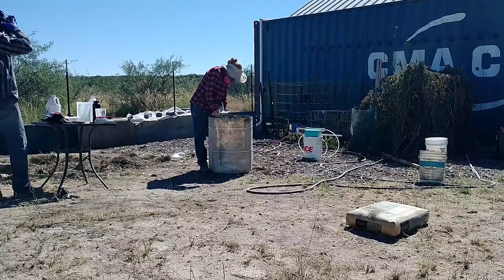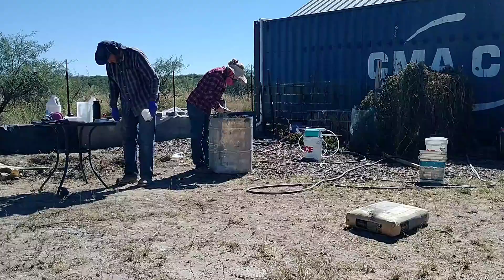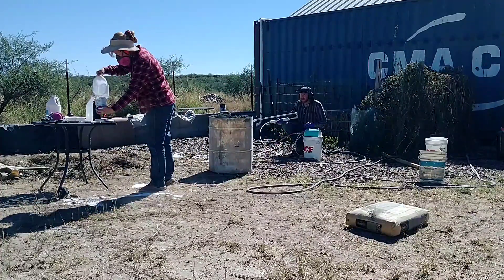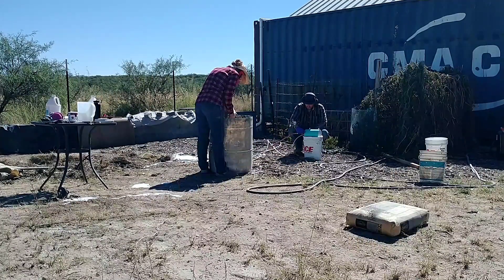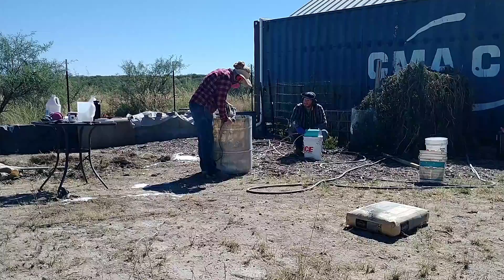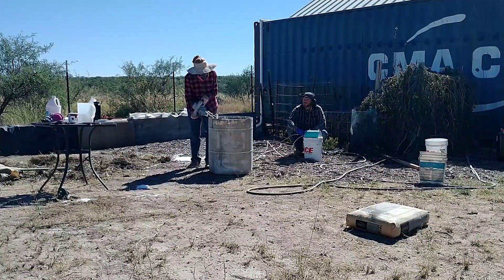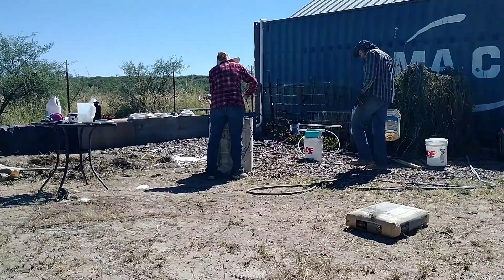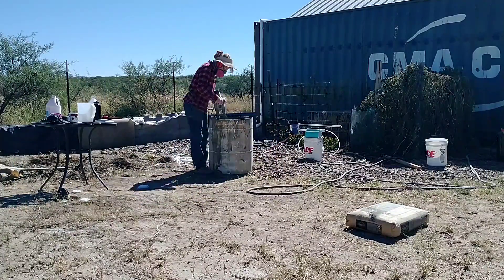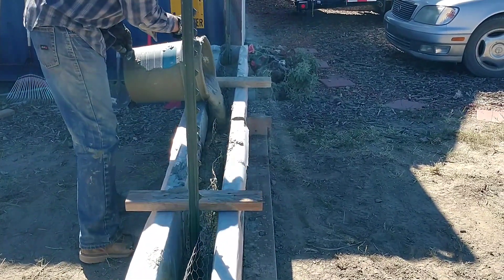We really didn't know how it would work, pouring that deep — whether it would hold up, and whether pouring one batch on top of another with 15 or 20 minutes between batches would cause the air bubbles to start releasing. What we found is that the aircrete seemed to hold up fine between batches, and pouring one batch on top of another didn't seem to affect it. We didn't see much settlement in height, so it held up quite well in this rather tall pour.